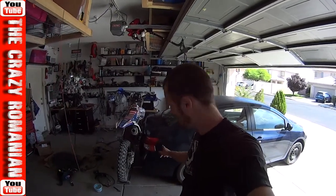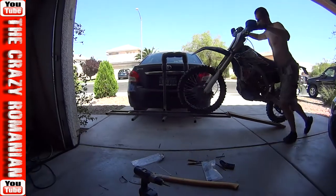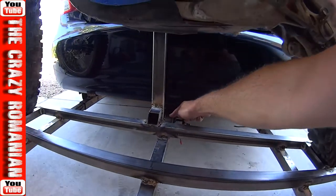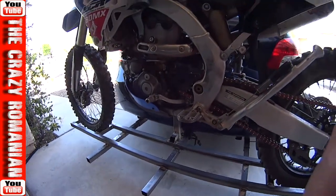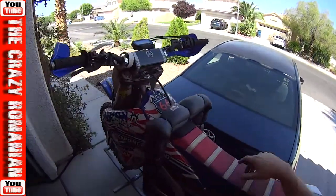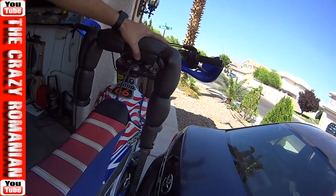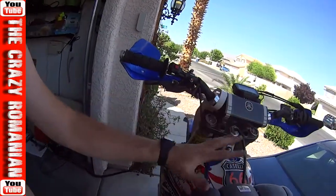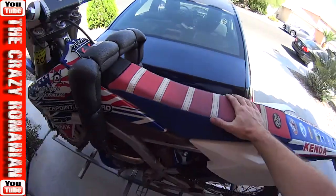The bike is loaded. Now for those who will say look at your suspension — I know, I'm getting spacers. There is a mounting point over here, a mounting point over here — this is 200 pounds, this one most likely 200 pounds, that one most likely 200 pounds — so 600 pounds worth of weight capacity. The bike is 250 and the mount is another 30, so we're good. There's a latch that locks into place, holds the bike down, and wraps around the trunk. The bike cannot slide because the peg would have to clear this — it's physically impossible.